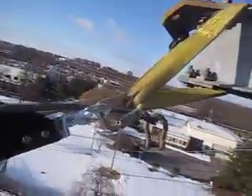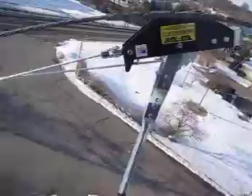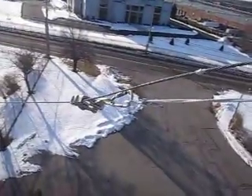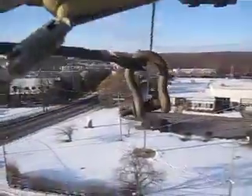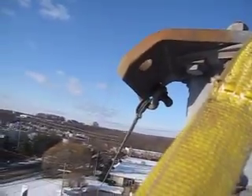First, you got to get the old guy wire out of the way to connect to that little hole there. Take a strap, a come along, and a Chicago grip to get the tension off this shackle, which used to be connected right there, and free it up for our new line.